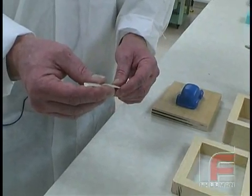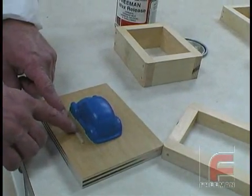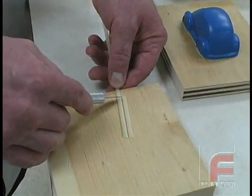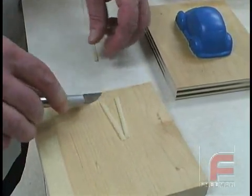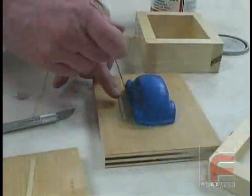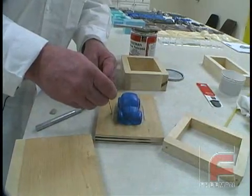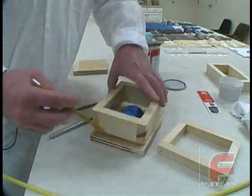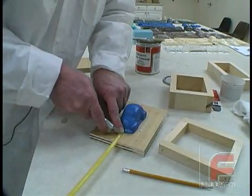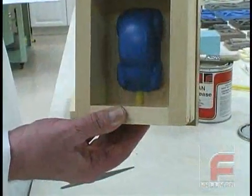To accomplish this, we've chosen Freeman half-round pattern wax, which is easy to handle and non-reactive with the silicone. We choose a length and cut the ends at an angle so the surface will draw easily from the mold, then make an identical piece for the other side of the model. We adhere the wax to the wood using clay and trim the excess. This will create an indentation in the rubber, which will later be filled during the second half of the pour, producing a perfect alignment and locking mechanism. Using a larger size of the half-round pattern wax, we create a gate. We mark the end of the frame with a pencil and cut a piece of the wax to fit exactly between the model and the frame, again using clay to adhere it to the wood.